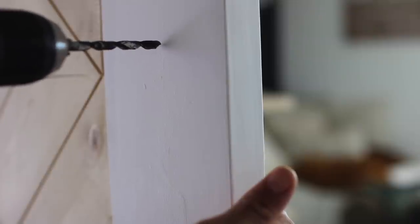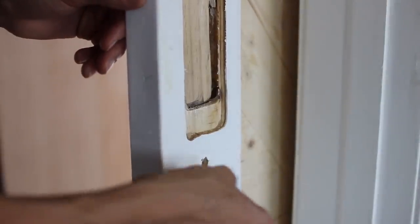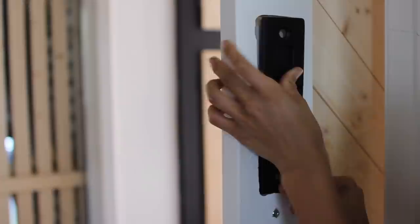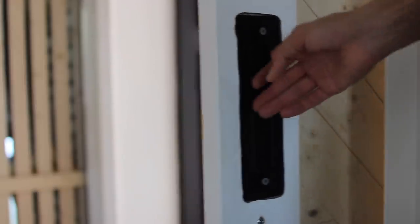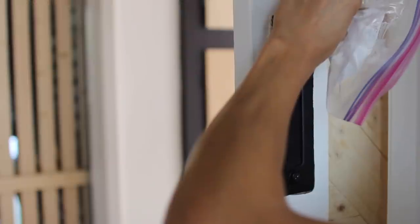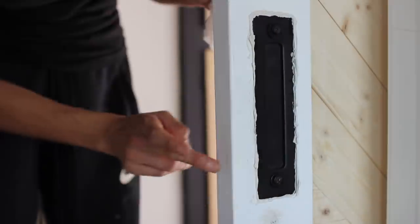When it comes to installing the door handle, that is completely personal preference like every DIY I do. Holly loves the more sleek look, so she had parts from two different handles that I combined to create something very sexy and sleek, tying in that black component from the track hardware above down to below. For the interior of the door, you always want something very flush because the door is going to be sliding left and right - you don't want something hitting the molding and stopping the door from fully opening. Most kits come with the proper door handle for the exterior and interior; I'm just mixing and matching, so wanted you to know.